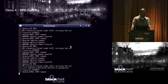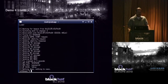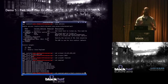And of course, a lot of people lately have given some attention to WPS cracking with Reaver, when it was discovered that that whole protocol is kind of vulnerable. Some of you probably know this, but with a lot of routers, if you go into the router and uncheck the box for WPS enable, half the time it's still on, right? So in a recent security class I was teaching, I gave them a lab, and I said, for this lab, I want you to use Reaver not to crack the Wi-Fi, but just to verify that your router has actually got it disabled. So it shouldn't be responding, things like that. So it works pretty well. Here you can see I successfully cracked my password. Or technically I cracked the WPS pin.